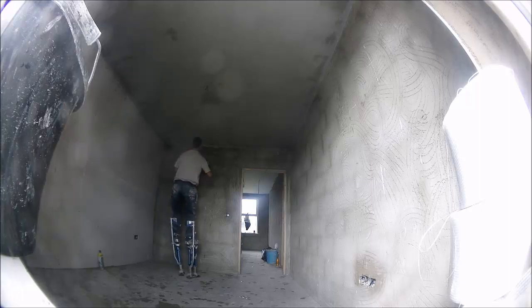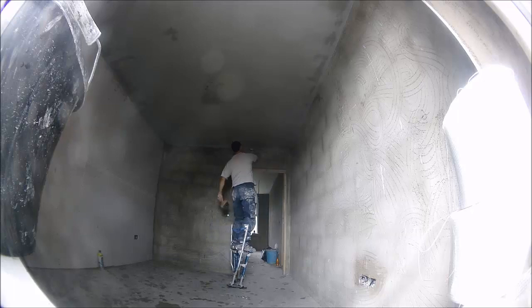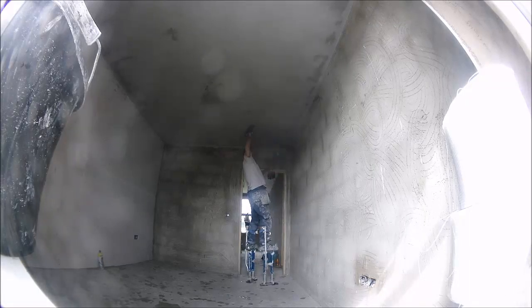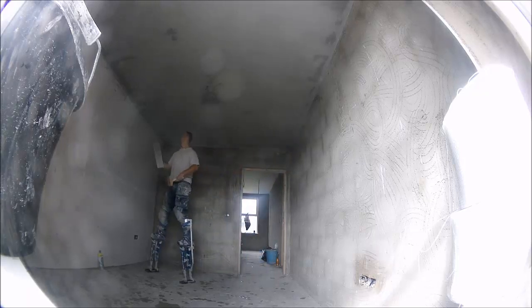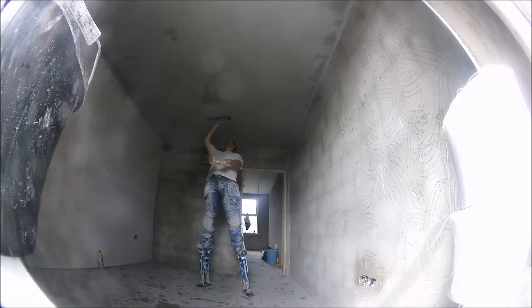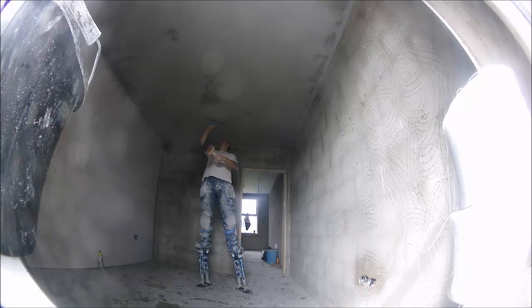Now this is the quick polish — you can see the ceiling is turning, which is another indicator that you're ready for the third trowel. All I need to do is wet the blade of the flex trowel. This particular one I'm using is a super flex or ultra flex — same as a refiner — and I find this one can give you a wee bit more cut, but they both do the same job and take a bit of pressure off your arm and elbow. You can do this stage with just a steel trowel, which is what I did the majority of the work with. I'd recommend stainless steel tools as they are a lot easier to clean and maintain.